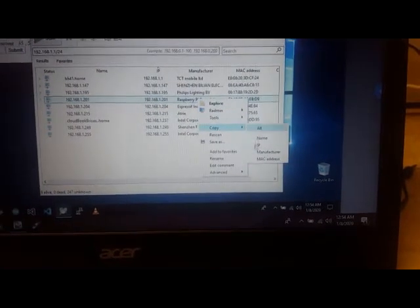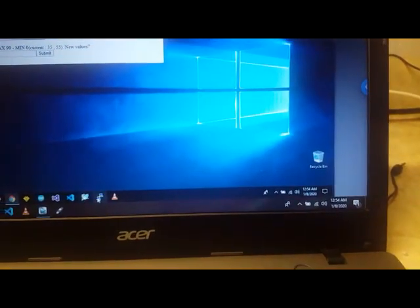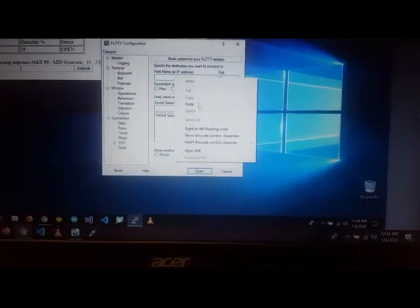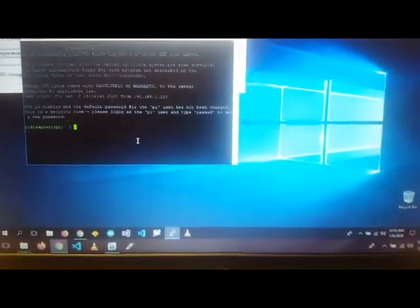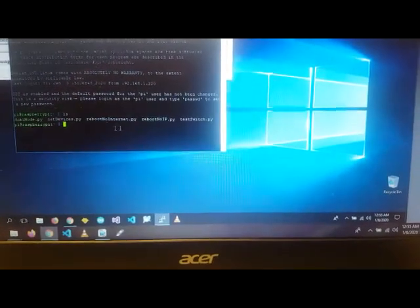Everything is connected right now. Everything is blue, showing it's alive. And I can do some stuff. I can secure shell to one of the security cameras that I installed upstairs to show you what the program looks like. I'm just gonna paste the IP address I got from Advanced IP Scanner, and I need to log in to the Raspberry Pi. And I'm being lazy. I haven't changed the password and user. Still defaults, but they're fine. I mean, maybe I'll change them later on, but for now they're still default names.